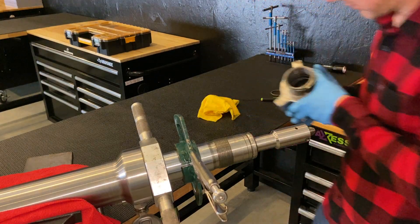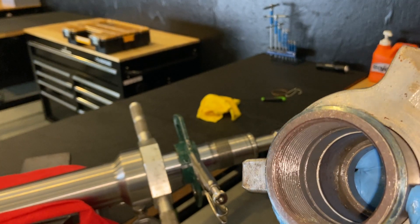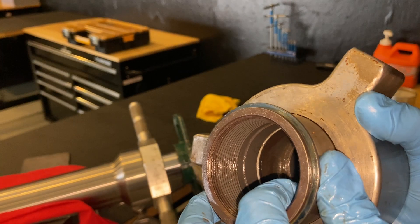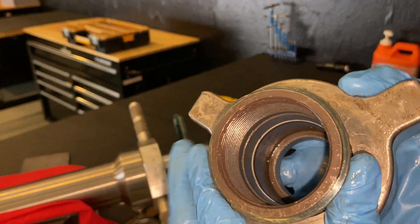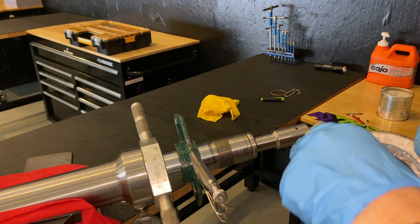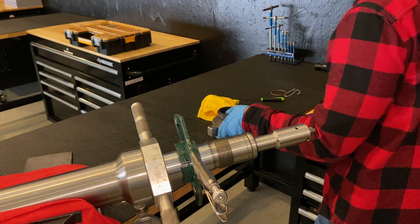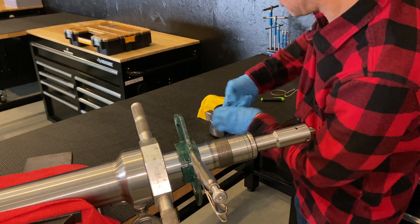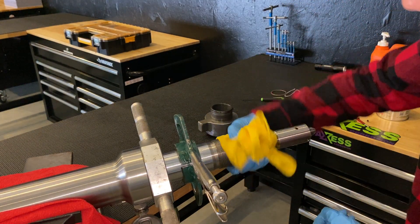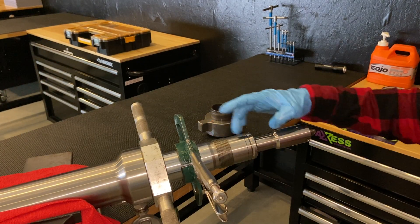Finally got that in. So that's it seated down into place. You can see the new o-ring in there with a backup ring on this side — the backup ring's on the thread side and the o-ring is seated all the way. Just make sure it is properly seated into that groove or it will catch on the way in. Give it another little layer of grease on the inside of the o-ring just to help installation onto the sealing surface, which is basically this section here — as that screws on it will just move up over the sealing surface.